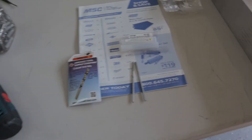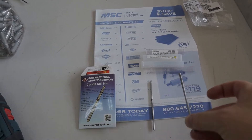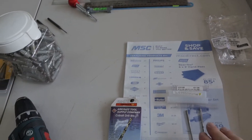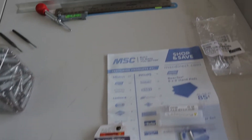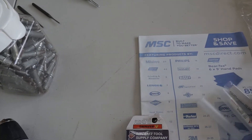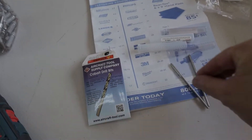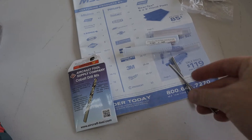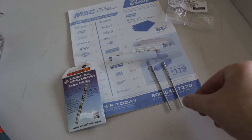Here is the number 30 reamer — this is actually a replacement I just bought. I got a 6-flute one, meaning there are 6 flutes and it's got a point on it. The older one was a 4-flute and cheaper. What happened is I set my drill down, dropped it, and my original reamer got bent so I couldn't use it. I originally bought it from Avery Tools or Cleveland. Cleveland didn't have it, and Avery's is no longer in business, so this one is from MSC Tool. These little containers for the reamers are really good. To clean up holes — if your rivet won't quite fit, just give a little ream in there. From 3/32nds I up-drill to number 30 and make perfectly round holes. When I bent my reamer I had to use a drill bit, which made a little more mess of the hole than a reamer would.